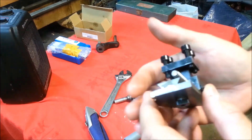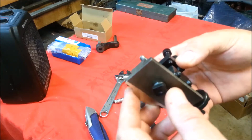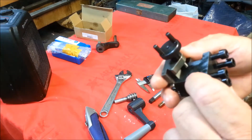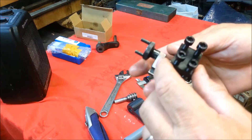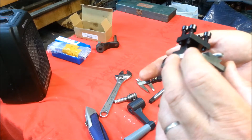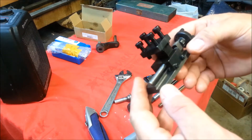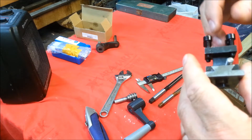Let's come back to my little baby compound here. You might wonder, well, if I put a riser block on and put this compound on one of these little lathes, how am I going to get the tool height right? I've got a kind of limited range of adjustment here. What I was thinking is the lead screw is off-center, and I could machine this off to a flat, then drill and tap it and install a little micro quick-change tool post on it. I ordered this so I could see if that was a possibility. The little thing looks like it's made really well.